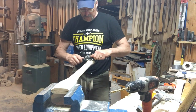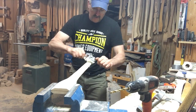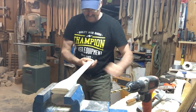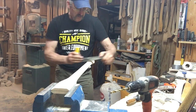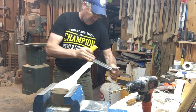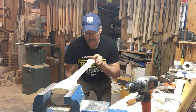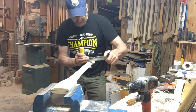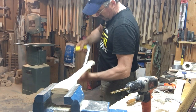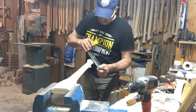That's as quick as it takes on a double bitter if you do it nice and uniform on your bandsaw. Now what we're going to do is smooth this end out into what we just did — roll it in there nice and smooth. Then we're going to switch over to the Stanley Surform to round out that palm swell. We're taking a little bit out of the hollow and taking off the edges to the octagonal finish from the bandsaw, shaping it right into the handle. Just round it over the same way.